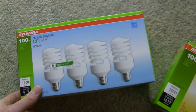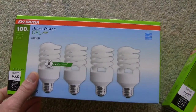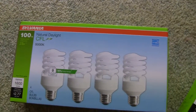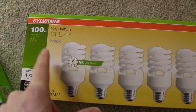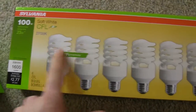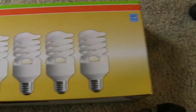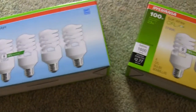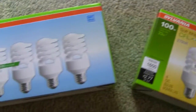The reason I went with this particular build is because I can find these parts cheap and easy at big box stores — I don't have to go online or wait for specialty shipments. These have a 5,000K wavelength of light, which is perfect for the green growth of plants. And these 2,700K bulbs add an extra light spectrum to give the plant a well-rounded spectrum to feed from. These are 23-watt, 100-watt equivalent bulbs, and should be more than enough to get the plants through the winter. This setup will also be perfect for growing indoor vegetables like tomatoes, lettuce, and herbs.